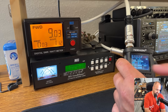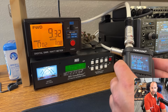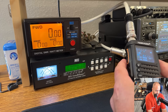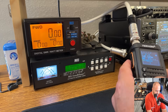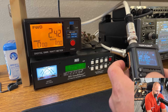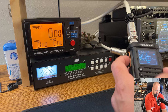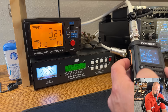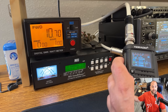So, not that advertised 10. We were running in split for some reason, but that's okay — I'll turn split off. It's about 9.3 watts. Sometimes they change a little bit when you go up in frequency, so let's check low power at 146 MHz — about 2.5. Here's mid-power: a little bit lower now, 4.3 watts — it was 5 watts at 144. And now high power: over 10 — 10.7 watts!